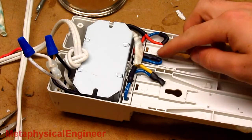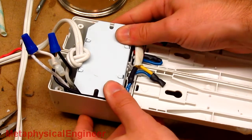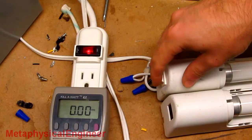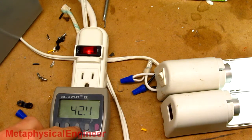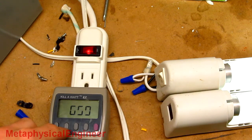Got the wiring all sorted and soldered together. I still have a bit of trimming to get everything to fit nicely, but it's ready for another test. Clicking it on — it fires right up. 0.34 amps, 25 watts or so, 42.5 volt amps for a power factor of about 0.586.